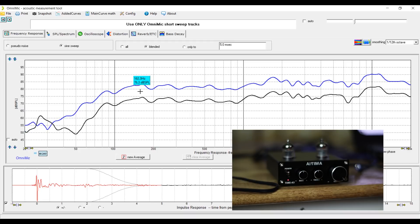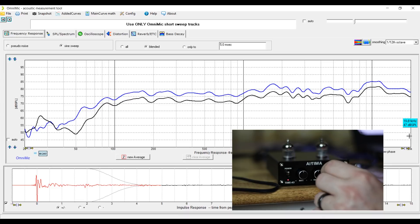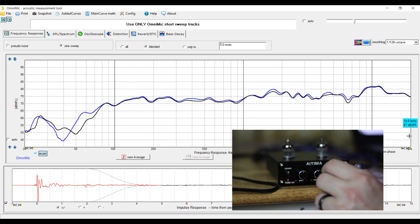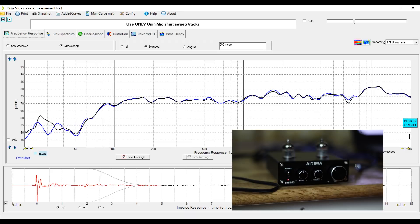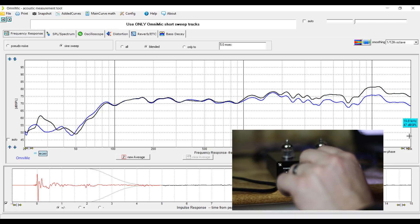Checking the different frequencies, the level has gone up evenly. That's something you do want to see, because some amplifiers — when you turn the volume up — can change the frequency response, having characteristics where the high end or the low end gets disproportionately louder. Bringing it back down to about that two-thirds volume where it's even, we're going to start checking the treble control now.